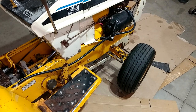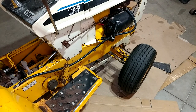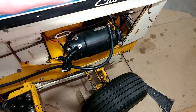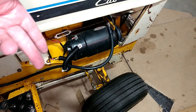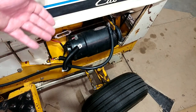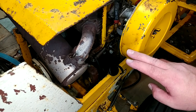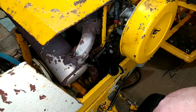I didn't notice any big improvement in performance, so I went ahead and made up a two-gauge ground and ran it straight up to the starter and then back to the chassis. That also seemed to make no difference whatsoever. I'm now beginning to suspect that maybe the actual magnets in the starter are getting weak. This starter was professionally rebuilt by a pretty well-qualified auto electric shop probably three or four years ago and it certainly helped, but I still don't think it's right. Before that rebuild I bought a Chinese one off eBay and it 100% didn't work — it was seized when I got it. So if I can't buy a new one and can't get it rebuilt, what do you do?